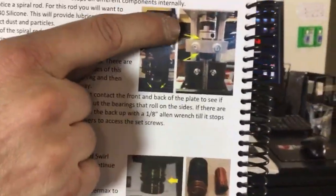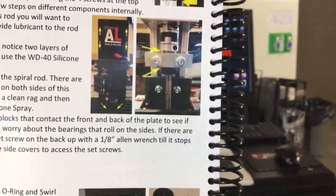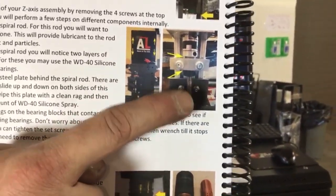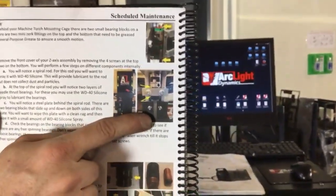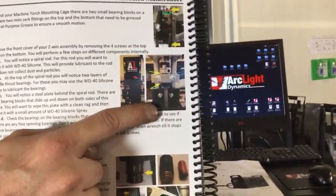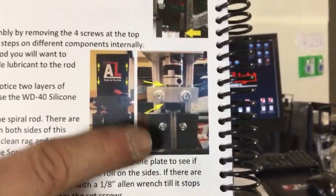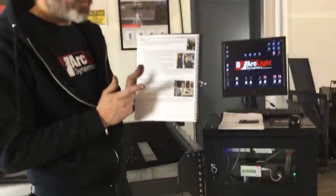It's important that you lubricate your needle bearings with a little bit of oil, such as tool oil or 3-in-1 oil, and then on a monthly or quarterly basis, it's a good idea to clean your threaded rod. You could use a toothbrush and some degreaser like Formula 409 for this. Your threaded rod can then be lubricated with a non-petroleum based lubricant. For your threaded rod, make sure you're using something like a graphite or a silicone spray.